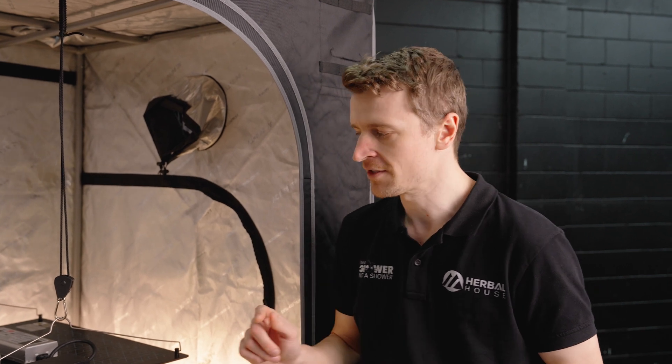Let's take a closer look at the dimmer module. It's got the analog dimmer on the front face, allowing you to start at 15% at its lowest setting and ramp right up to 100% in 10% increment steps. It is directly proportional to how much input power the light is pulling — so if you set this to 50% you are pulling half the power the light has to offer. That's really good in terms of efficiency for people who need to squeeze that light down nice and close.